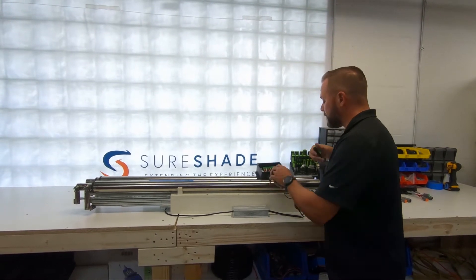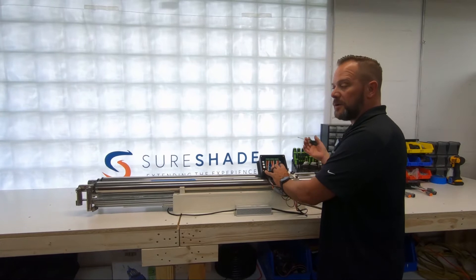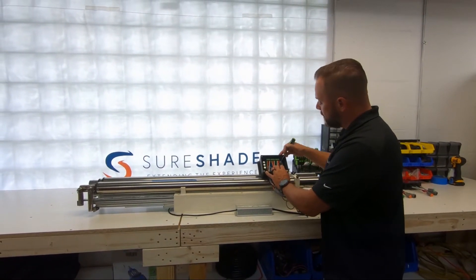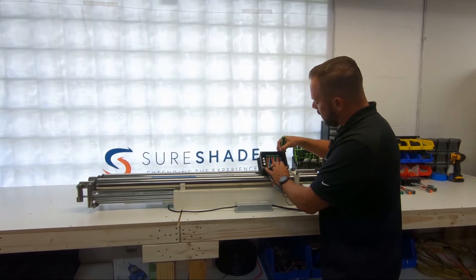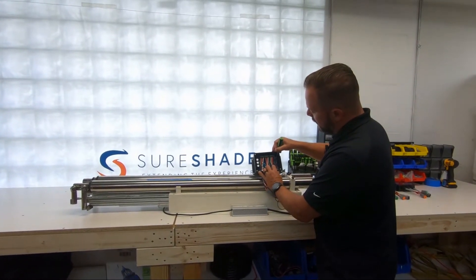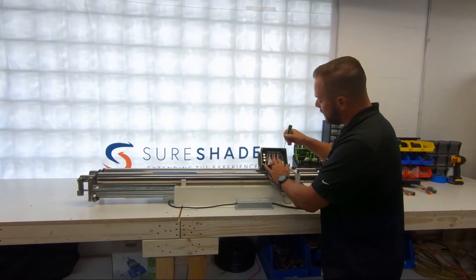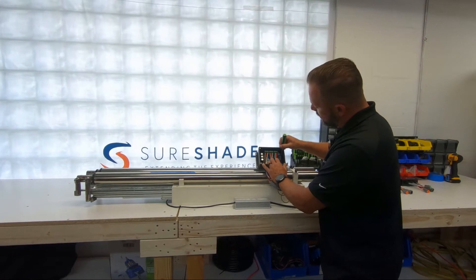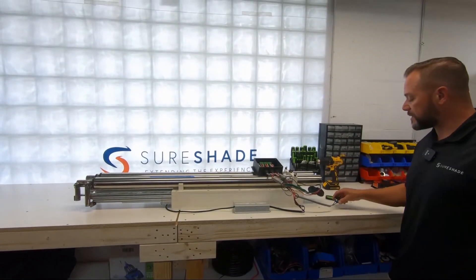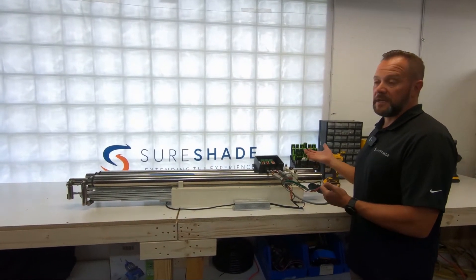Come into your control box. The first step in this process: you don't need the system to come in any more than it already is — it's already jammed up. Come up to number seven, turn number seven on, hit the set button, then turn number seven off. Now, if the port actuator is the one that's jammed up, turn on number five so that we can individually control the port actuator. Then hit extend.